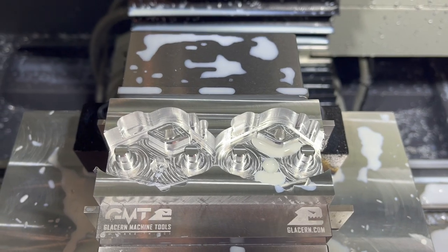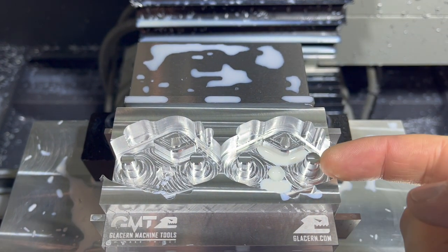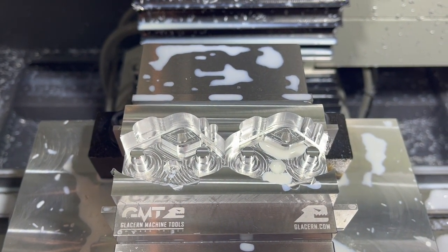So as you saw up in Fusion, could have done the bore down on the outside, but I didn't want to sit there and spin around all that. So we should be going in and taking just one side mill cut all the way around just to tickle those down to the size that we need. Should be a pretty quick op.